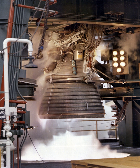The propellant feed system consists of separate fuel and oxidizer turbopumps, the bearings of which were lubricated by the fluid being pumped because the extremely low operating temperature precluded use of conventional lubricants. The system also included several valves including the main fuel valve, main oxidizer valve, propellant utilization valve, and fuel and oxidizer bleed valves, as well as fuel and oxidizer flowmeters and interconnecting lines.